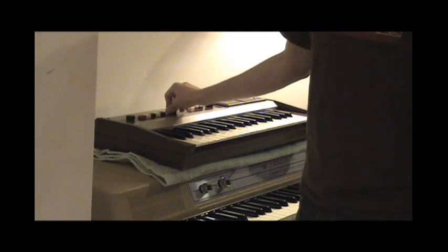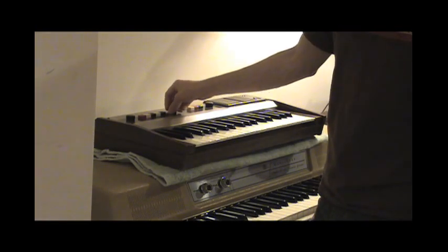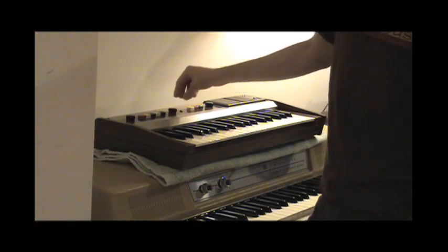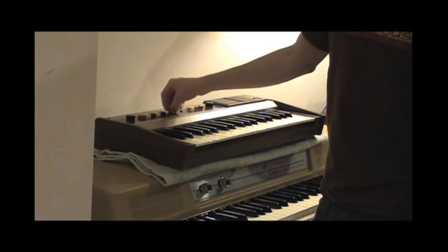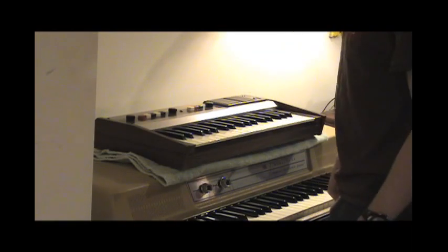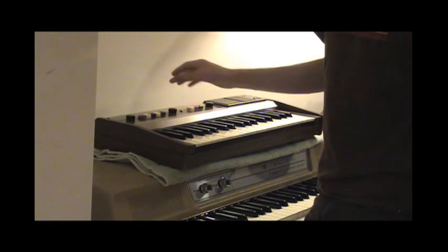Now of course this synthesizer, I didn't design it with any kind of envelope generation or any kind of amplitude control other than an output level potentiometer, which will be on the final product. So that kind of thing would have to be done with a separate unit. Of course it probably could easily. In fact, it definitely could easily. But yeah, so that sounds pretty straightforward.